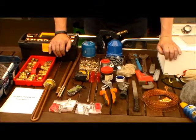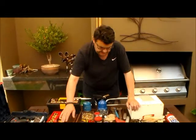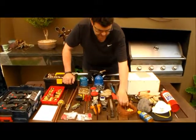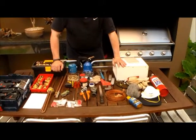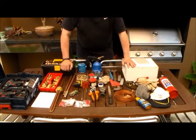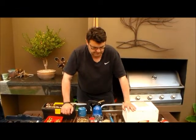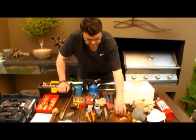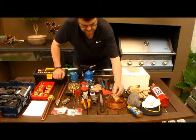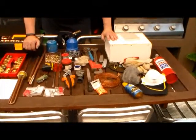When you do an installation of a hot water system where there's electricity involved, you must make sure that the two ends of the piping going into and coming out of the water heating system are properly grounded and connected to each other. So here's some earth strip and some brass screws — I'll explain a little bit later why I use brass screws.